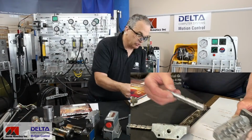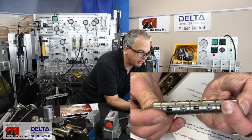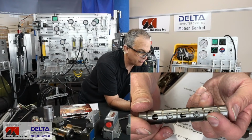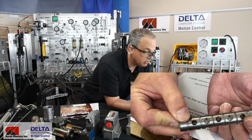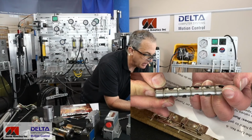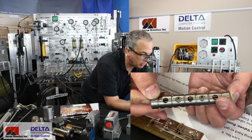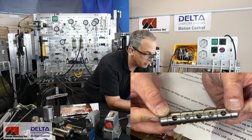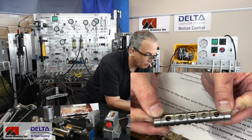And if I take that spool sleeve back out again, and we just have a look from the opposite side, we see those triangular metering notches for this design. And there were 4 all the way around, but we've cut that spool sleeve in half. And maybe if I just try to get it in the center here, you might say to yourself, hey, is that valve spool now closed? Well, I did measure that with my digital caliper and found that the measurement there is just about identical, perhaps not exactly the right instrument to give an accurate measurement, but you can see that I don't have to move very far from the center position, and I've uncovered the work port on one side or the other.